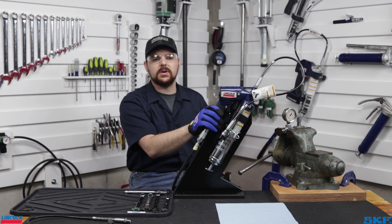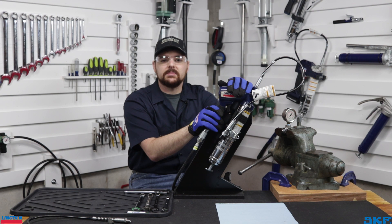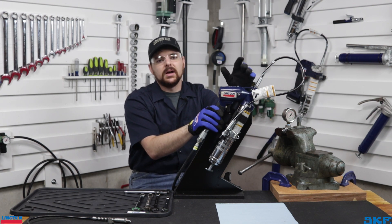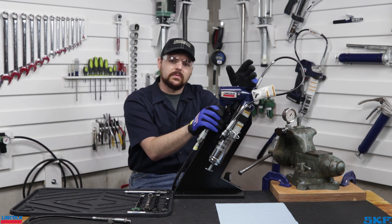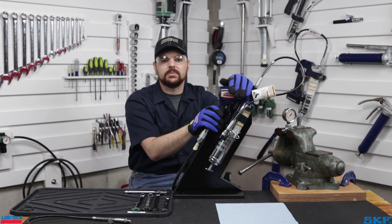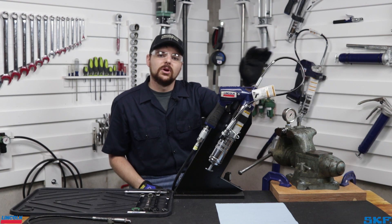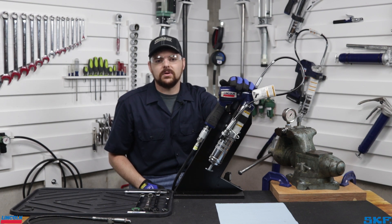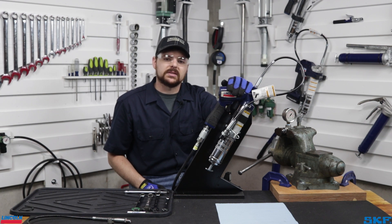Cleaning is done and the hose as well as a new coupler are installed. The gun has also been primed. If you require the steps to prime a grease gun, please see the link above or in the description. A couple of suggestions during priming after this cleaning: cycle at a low rate to allow time for the grease to enter the plunger chamber, and to give maximum flow, prime the gun without the hose attached. The hose attached could cause it to become airbound, so cycling with an open end may be required to get the flow going. Once you see grease dispensing out the open end, the hose can be reattached and the priming process completed.